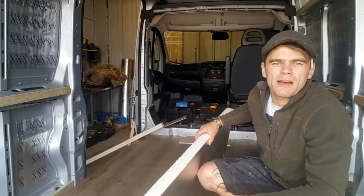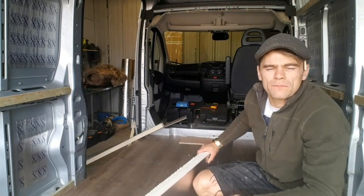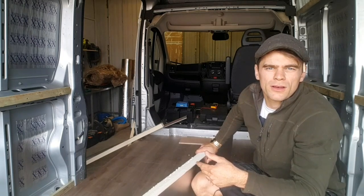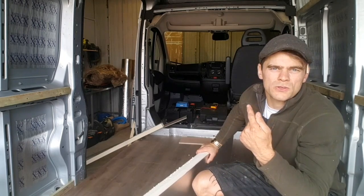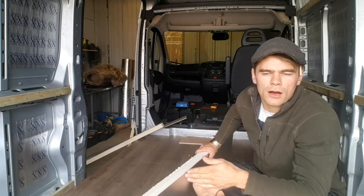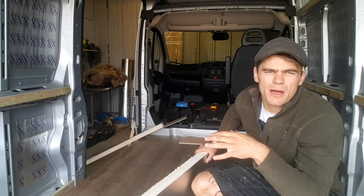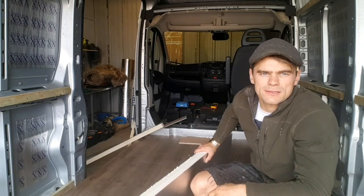Cutting the Celotex this way makes a nice clean cut which really helps with the friction fitting. Because the Celotex board is rigid and the ceiling is slightly curved, I'm going to make grooves in the Celotex board at 45cm and 95cm, which will match those on the battens. I'll put a cut on one side of the board — the other side will have the foil still intact — so it will remain as one board but will be able to sit flush against the battens.